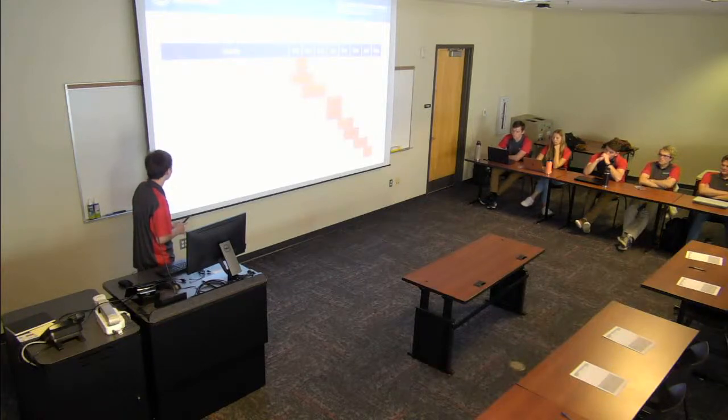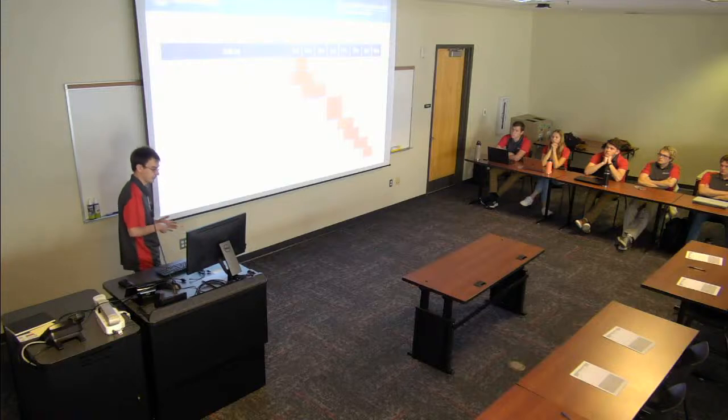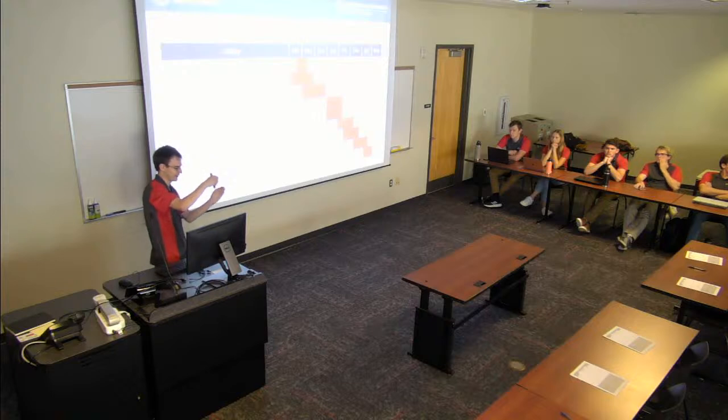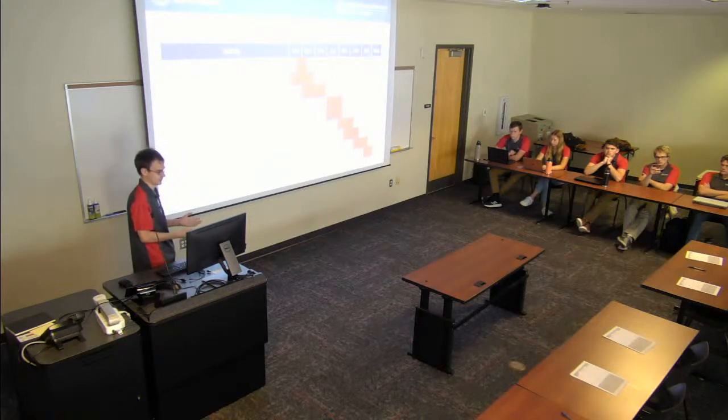And for the rest of the semester, we're building this CubeSat payload bay, testing the payload concept, and taking the system design. I just ordered the materials for the CubeSat a couple days ago, so that should be in a few weeks. We'll start out at the machine shop for that. Testing the payload concept, we're going to make a test rig. It's a spring, a magnet, and a coil around it, hooked onto a fastened rig. We're going to have a voltmeter there, and we're going to oscillate the magnet and see how many volts it generates.